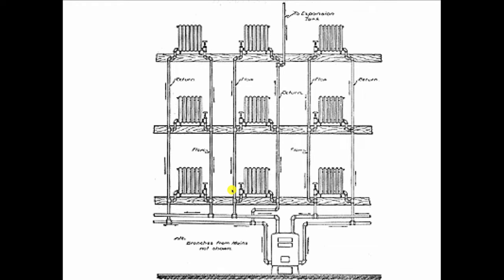He says, "Well, take my advice. Take them out of the top floor radiators and put them into the bottom." And I never knew about these things because nobody told me. So we go there and pop the union, and sure enough, there's an orifice plate in there. So we take it out of there, we put it down on the first floor, and everything starts to work as it should. Who knew? The old timers never wrote it down. They kept it secret. So we learn a lesson as we go along, and it's a good one.